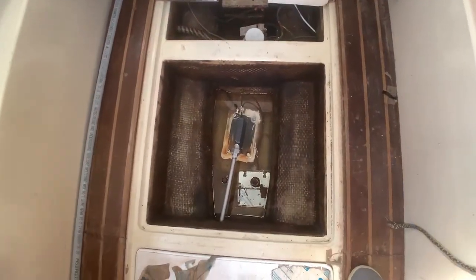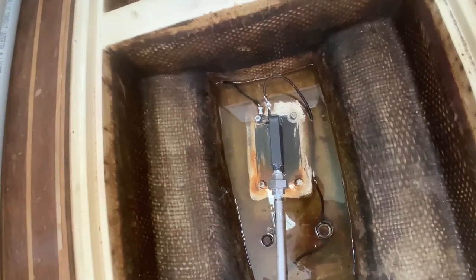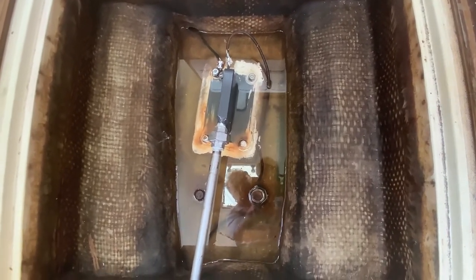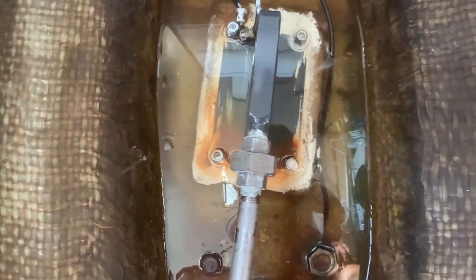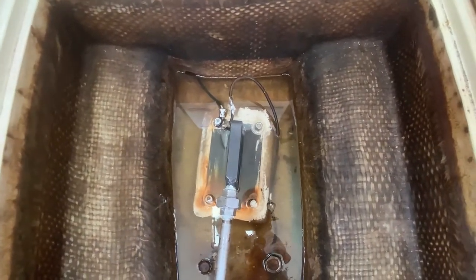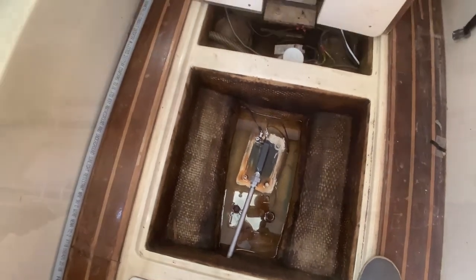Here you see the final exit point of the pipe — that block and sheave were also in good shape, so we had both cleaned up, repainted, and mounted back on. The boat was completely dry until we had to reset that joint, which brought in a little water in the bilge that I'll pump out. I need to confirm there are no new leaks, but that's the whole system for the center board. So far so good — that's the full report on the rebuild of the center board for Reverie.